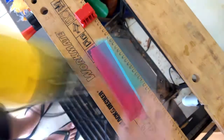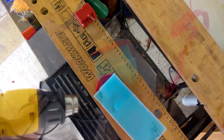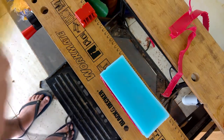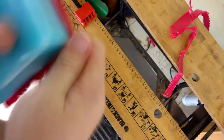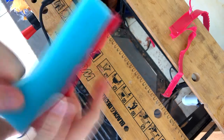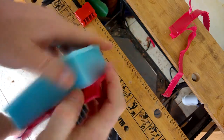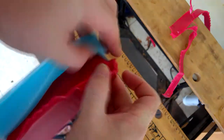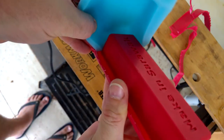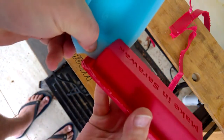This took me about 5 minutes with a heat gun, but if I'd sprayed the release agent properly in the first place, this never would have happened. You can see where it's sticking — in particular where it never quite managed to get into the mold from the angle that I was spraying it at.